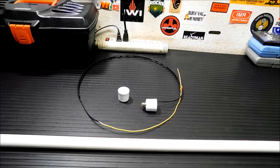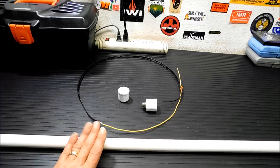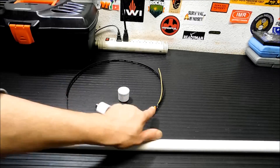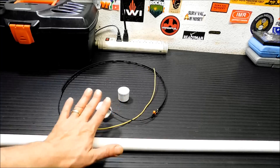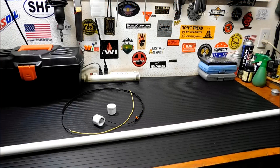This is a 50-ohm feed impedance. No ground radials are needed. It's five feet long. The antenna feed point is 10 inches above the connector, so U-clamps, hose clamps, and everything else can be used down at the bottom without affecting the SWR — it's a non-radiating section. It's a half wave on UHF and half wave on VHF. Maximum power is 75 watts, and he does offer a 250 watt version. It has 2.1 dBi gain on both 2 meters and 440. He offers different ham bands — you can get one for 220, or for business band radios in the 151 MHz frequency range.